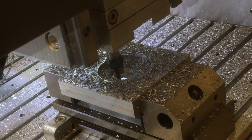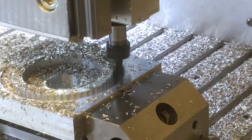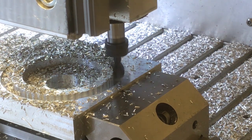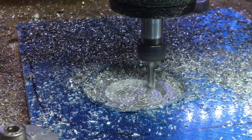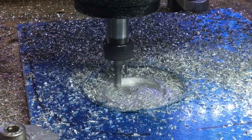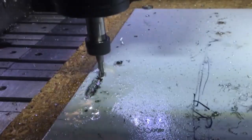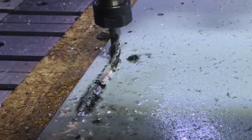Now the one thing they all have in common is you end up machining these aluminium parts. Some of them are pretty thick and you end up with lots of chips. The problem when you generate lots of chips like this, especially when you can't evacuate them, can't get them out of there, is they can bind up and start jamming the cutter. You can use a hand spray — I do use a lot of WD-40 in a hand spray there. I also use the vacuum cleaner, but occasionally it just gets the better of me. And this is what happens.